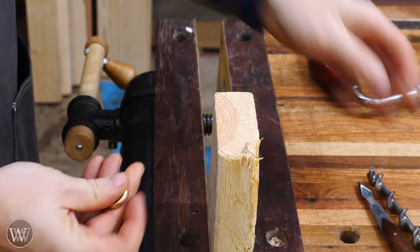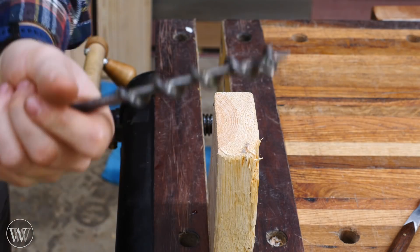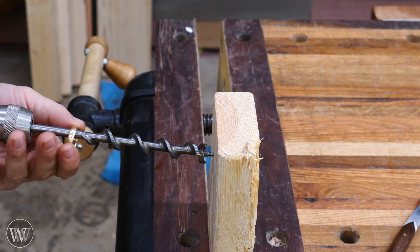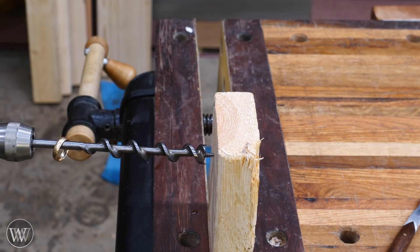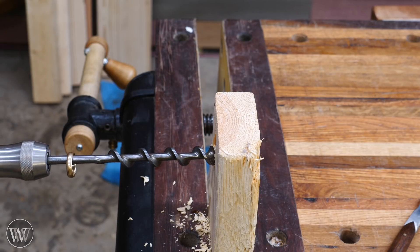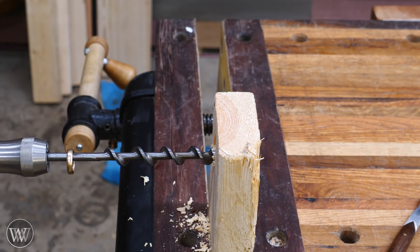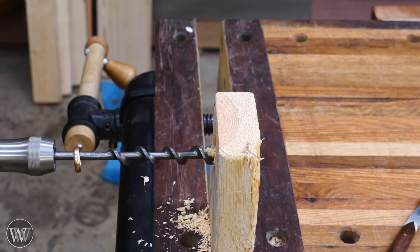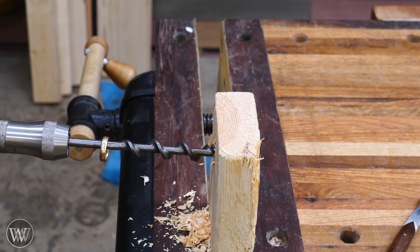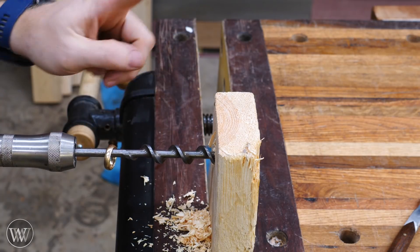First up, you just want to take your wedding band off, slide it under the shank of the bit, chuck it up in your brace, and go to town. The nice thing about this setup is that if you're too high the ring will slide in, and if you're too low it will slide back towards you. You can sit it in your gut and move it back and forth until eventually the ring starts to stay in the same place. You can very easily tell if you're out of plumb side to side because you're looking straight at it, but up and down is a lot harder from on top. So if you keep this in place it lets you know if you're going too high or too low — if you see it coming back towards you, lift it up; if you see it going towards the bit, drop it down a little bit. It's a fairly simple way to drill a perfectly level hole through a board.